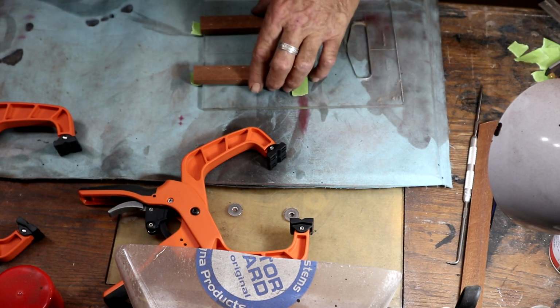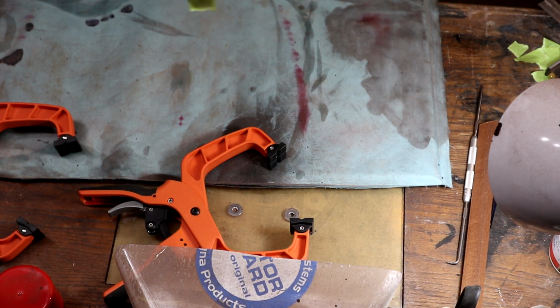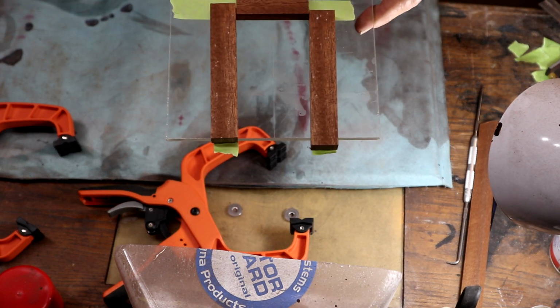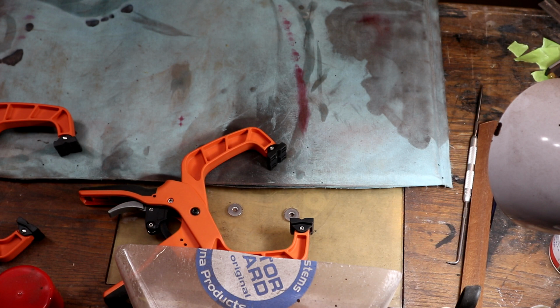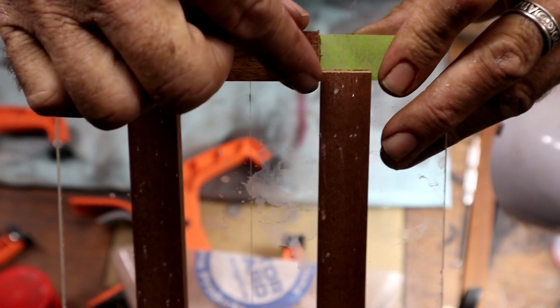And I can feel that I had to move a little pressure on it to even get it out of there. So we're good. What we've created is a cavity right here that we need to cut out. So I don't want to hog all that out with the router. So we'll take it over to the bandsaw, and I can see my shape where I scribed that in on there. We'll be fine. I'll just kind of finesse that in with the router. It's mainly right here in these two corner sections.